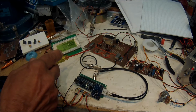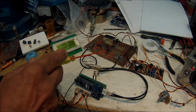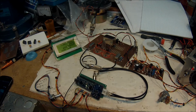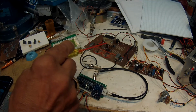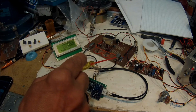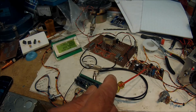So it's an SBL1 here, that's the receiver transmit mixer, goes into two bilateral IF amplifier stages, which is a combination 2N3904, 3906, and you can look this up in EMRFD. I think it's figure 6.111, and this is not something I invented, it came from Plessey. This is a GQRP 9 megahertz crystal filter. Another stage here, this is an SBL1, which is acting as a product detector balance modulator. Goes through a two-stage audio amplifier, which is a 5351... driving an LM380, so plenty of oomph there.